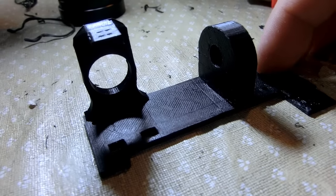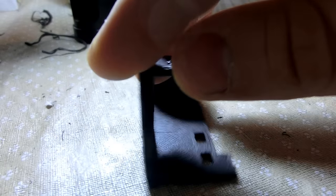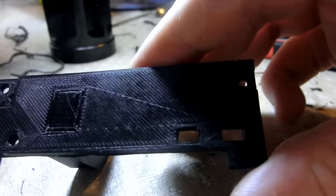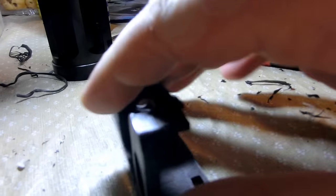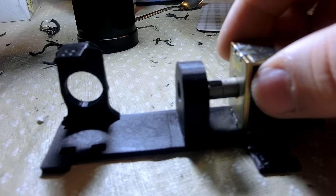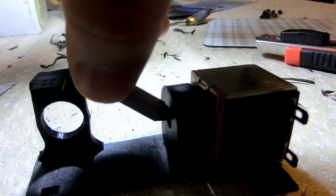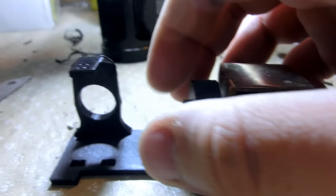Scraping off the edges with a razor blade also helps pushing the parts together, since the lower part is always a little bit thicker, since the hot bed plate is melting the plastic very slowly and makes it flow on the lower side. And I'm trying to put the parts together to see if everything fits, which it does. Now I can keep printing and finish the first test model.